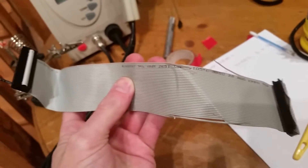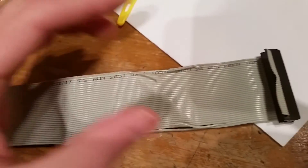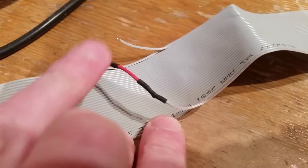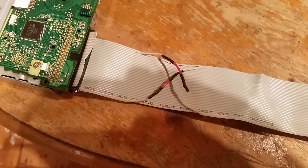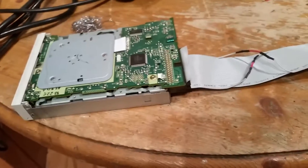What we've got to do is cross over pins 34 and 2. Using the X-Acto knife I've just gone down here carefully, separated out those cables, and then I'm just going to literally solder-bridge that to that and that to that. Bridging piece of wire, heat shrink — we'll try that out. First half of our crossover cable. You can test which pin corresponds by putting your multimeter on the pin on the drive and going along the wires to work out which one it is. That's the first part of the crossover cable. Now going to do the other side. That's the crossover cable complete — shrink mount. Check the continuity is right. So now pin 2 goes to 34 and the other way around. Sealed it with tape.